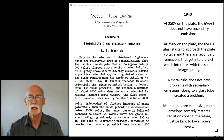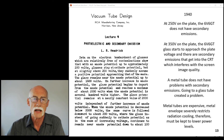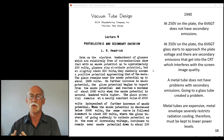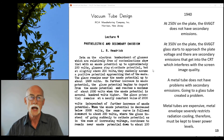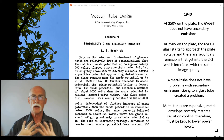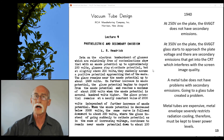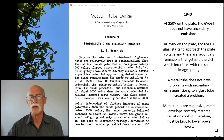That's the reason I say: if you've got one, use it. Even back in 1940 in vacuum tube design, what they noticed was — going back in time — they needed a 6V6 GT because they needed a stronger tube for television work and driving CRTs. When you start bringing the plate voltage up over 200 volts, the envelope charges and becomes positive with respect to the cathode. When they get up to 1600 volts, related to CRT work — we're talking flyback transformers in the back of the tube getting you up to the 1600-volt-plus range — they noticed that even in a 6V6 tube the glass is charging from secondary emissions, and this is significant even at 350 volts.